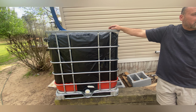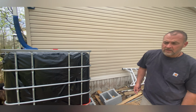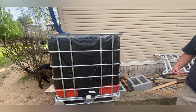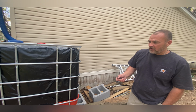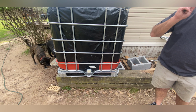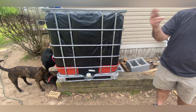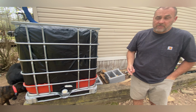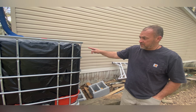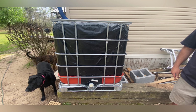I mean, we got what, a 10 by 10. There's a 10 by 20 sheet, and for these tubs you use 10 by 14. If you cut it like that, you lay the spout side down across the 10 feet part halfway, and then wrap it up like a Christmas present, like Missy said, using the black tape to tape down all the creases and anything that would be exposed.